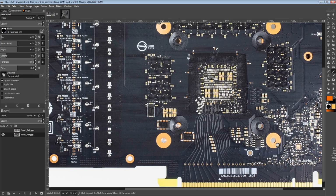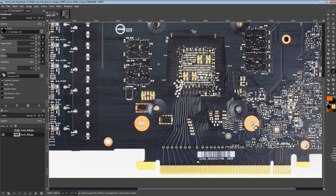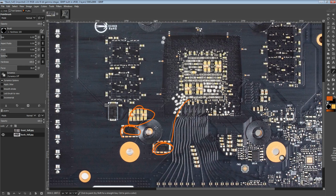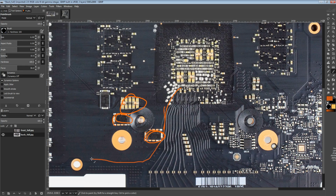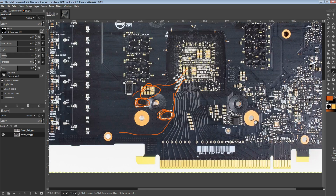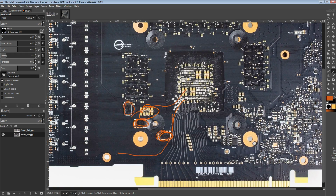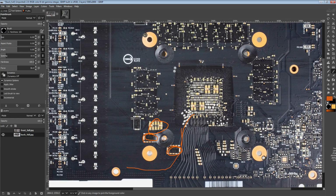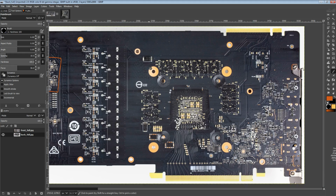But MSI, because they opted for a bunch of through holes, you still see the surface mounts jammed right up against where the GPU core is, right? Because that, like, get back the orange. You can see the V-core power plane going up to the GPU core right here. And so these are there for the GPU core. Those aren't on memory power. This one is, because you can see this end is on the actual memory power plane. So anyway, that's just kind of interesting observations.